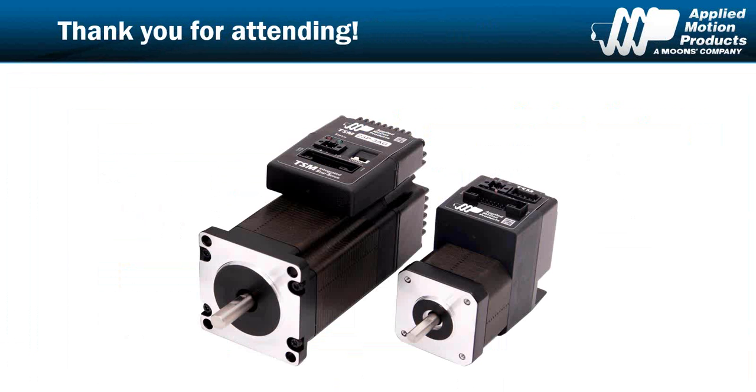All of the tuning parameters for the motors and for different load inertia mismatches are included with the software. So tuning is very straightforward and simple. You just select the motor and then the amount of inertia that you have on load, which typically you're going to estimate as either 1x, 5x, or 10x, and then it's a very simple download to the controller and you're done.